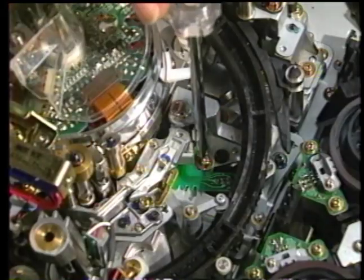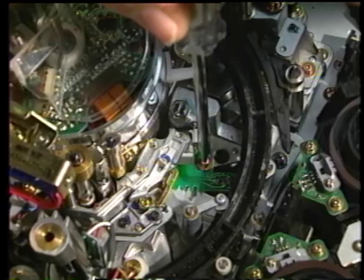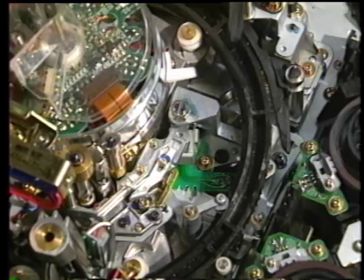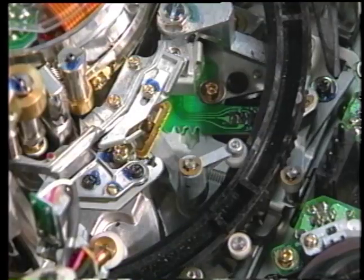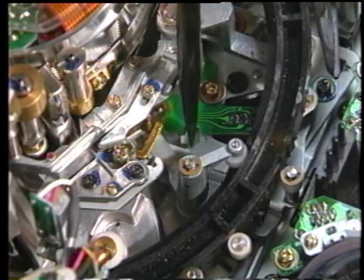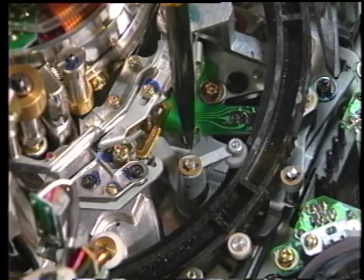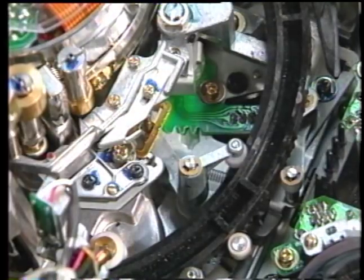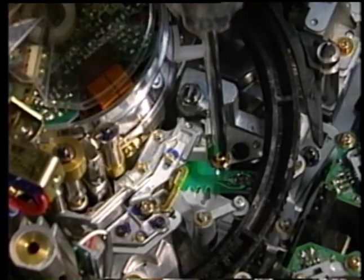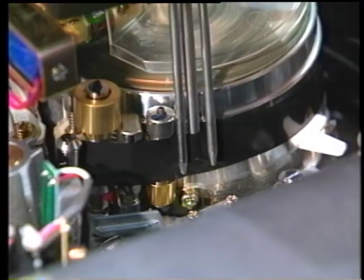Loosen the mounting or fixing screw approximately 1/4 to 1/2 turn. Using a medium-size 6 mm or 1/4 inch wide flat blade screwdriver, move the TR18 board away from the video drum to increase the back tension or toward the drum to decrease the tension. Tighten the fixing screw, taking care that the position does not change during tightening. Insert a normal cassette and recheck tape tension.